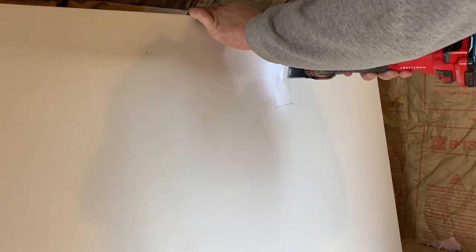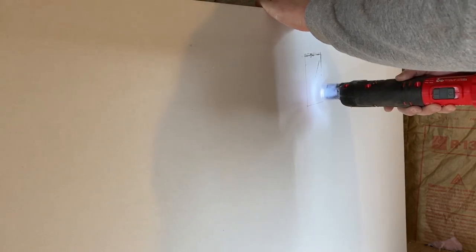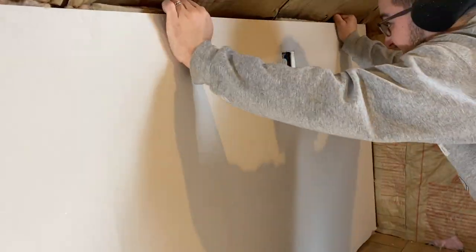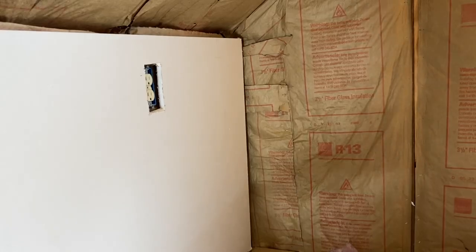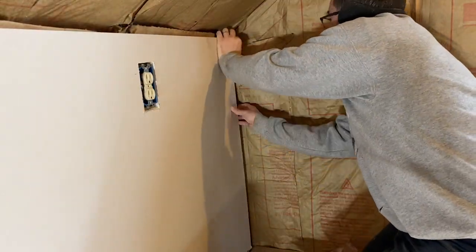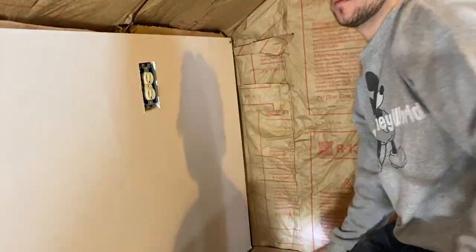After installing the flooring, we started on drywall. This was my first time doing anything with drywall, and starting on a pentagon-shaped attic was probably not the best idea. But the process was pretty simple. We just had to cut each piece to size and then use screws to attach them to the studs. I have to say, that's much easier said than done.